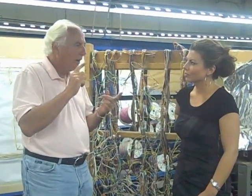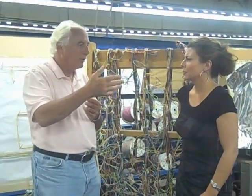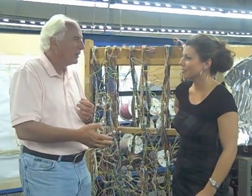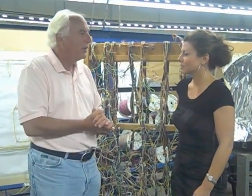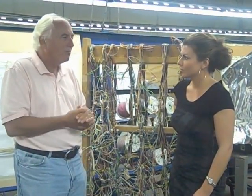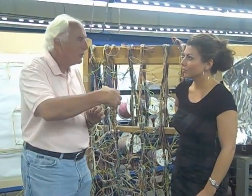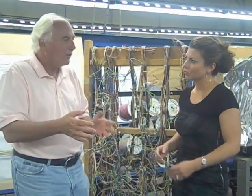They're $1,000 a piece for the gun. Jeez. And for the hanger. You'll see that there's a hanger on these that keeps the weight off of the operator so they don't get fatigued. We also are going to check and adjust the torque on them once a month so that they're not overdriven. We're going to start mounting things on the playfield, and we're going to solder the cable on it, and then we're going to test the playfield.